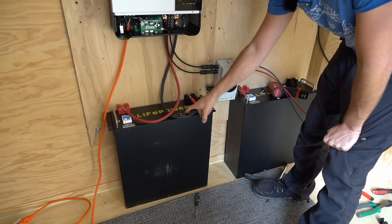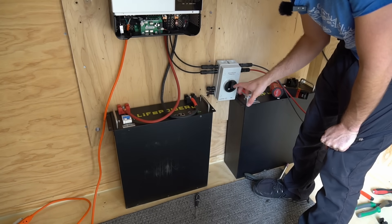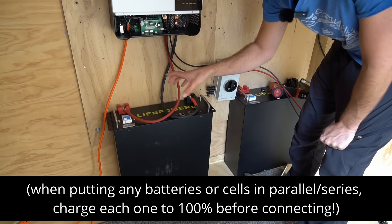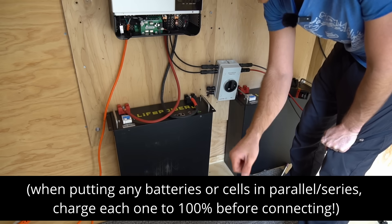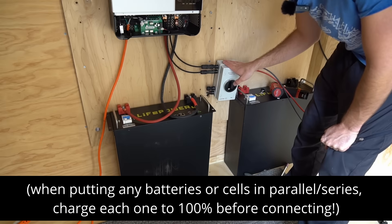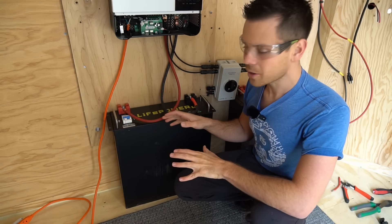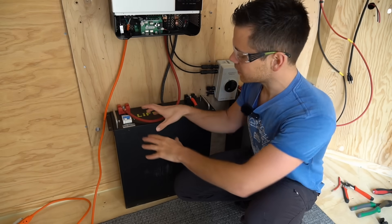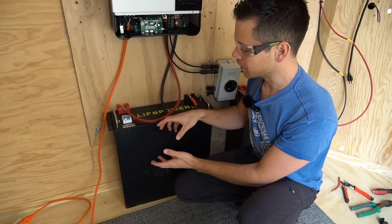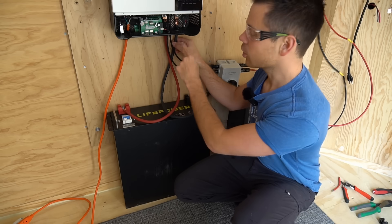If this battery is too small you can always add more in parallel, but you need to ensure everything is off first. Disconnect the solar, turn off every single battery, and turn off the inverter. Then connect more batteries, flip the batteries on first, flip the inverter on second, and flip on the solar third. These batteries are so easy to use nowadays — each battery pack has its own shunt, its own communication, and its own breaker, so it's only two battery cables going up to the unit.